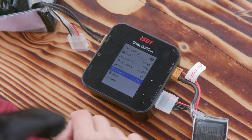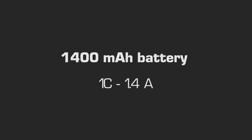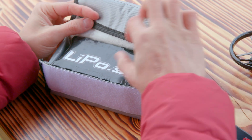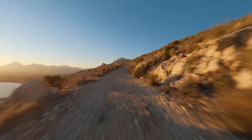You'll need to set how quickly you want to charge your battery. The safest way is at 1C — meaning 1 times the capacity — so for a 1400 mAh battery, that's 1.4A. If I'm charging at home with plenty of time, I'll charge at 1C. It's the safest method but slow, taking around 35–45 minutes depending on how empty the battery was. If I'm out on a shoot and need the battery charged fast, I'll charge at 3–4C, which for a 1400 mAh battery means 4.2–5.6A. If charging that fast, make sure to fly it immediately after.